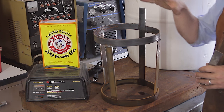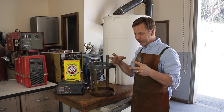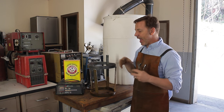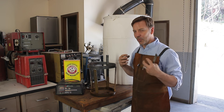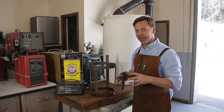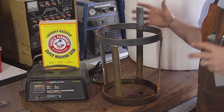One of the other reasons I've gone with flat stock like this is it's easy to clean. As the rust is pulled away from your part, it attaches to the cage in large clumps along with the washing soda. I'm going to show you why I use this flat stock — because I can just take a putty knife, come around, and scrape it off and get it working again. All that crust slows down the electrolysis process, so you want to be able to clean these cages often.